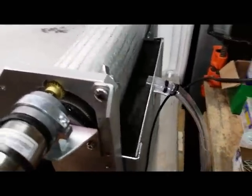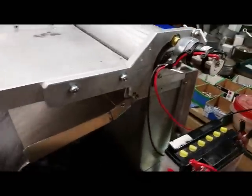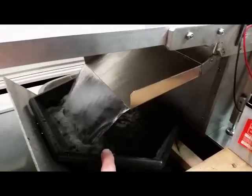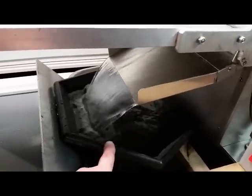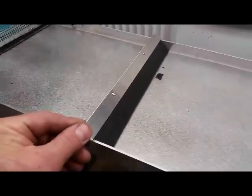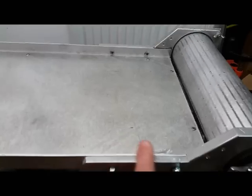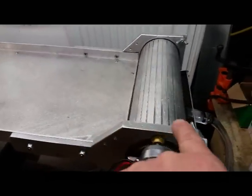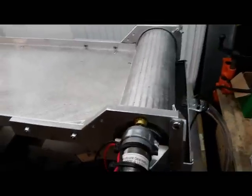Of course it fills up in your waste bin. There is a good possibility you could have some light magnetics end up down in here that are just very weakly magnetic, but that's really not a big problem — it's very rare that I see much of that. This little device will actually slow down your materials somewhat, and if it seems to be a problem you can take it off. I just noticed that sometimes, especially when I video for the public, they see some light dust or brown floating material come over and automatically assume your gold is floating away. So I just put it on there as an option for the owner to take as their own choice.